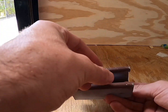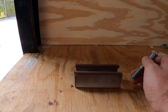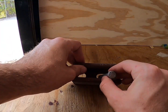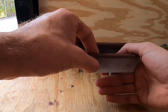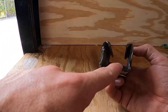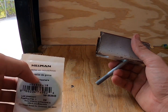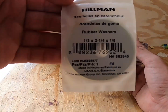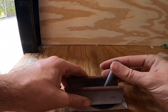Zinc will rust. So imagine the floor right here is our roof. We have this 3-inch galvanized bolt, and imagine there's a washer as well. It would go right through into the bus like this, with your washer inside the channel, to help with the pressure, and obviously the bolt goes right through there. Get a washer that will fit this width right here. Since our bus has a thin sheet metal roof, we didn't want metal-on-metal contact with our roof, so I got this rubber washer and put that on top of the roof, lined up our holes, and then it goes just like that.